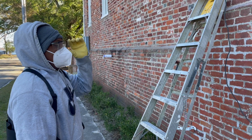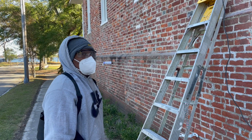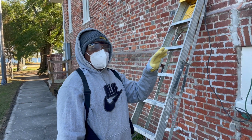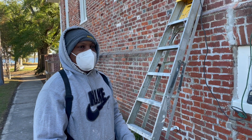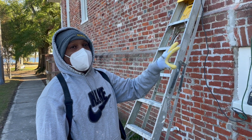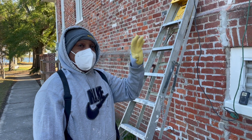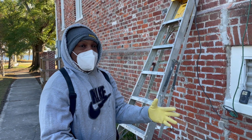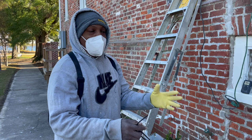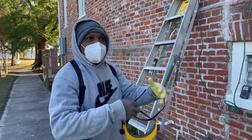Tell me the last thing about burlap. You told me how you use it. Well, burlap can be used in 2 or 3 different ways. During the summertime, if you're doing lime pointing and you need to keep the wall moist, you can wet that burlap down, and the brick and the lime constantly pull the water out of the burlap. So that keeps the wall moist.